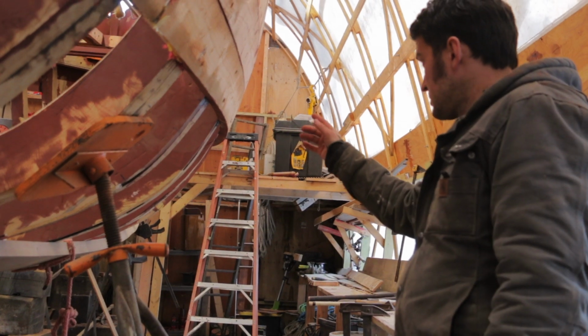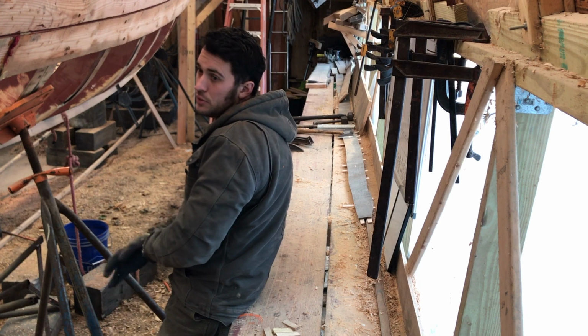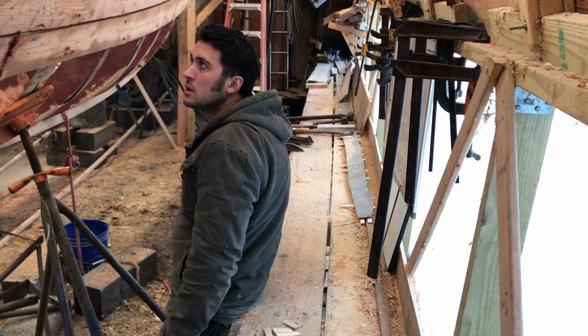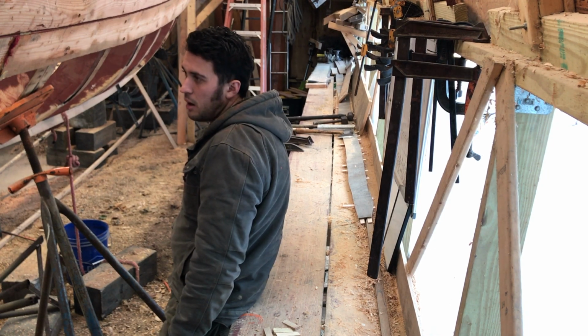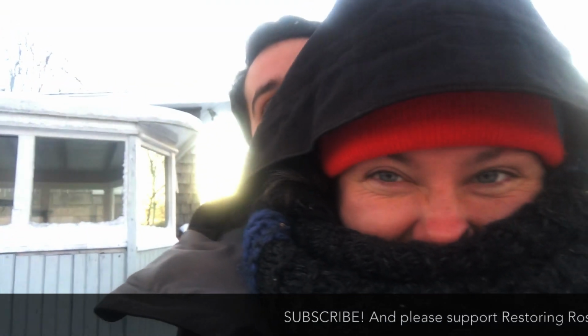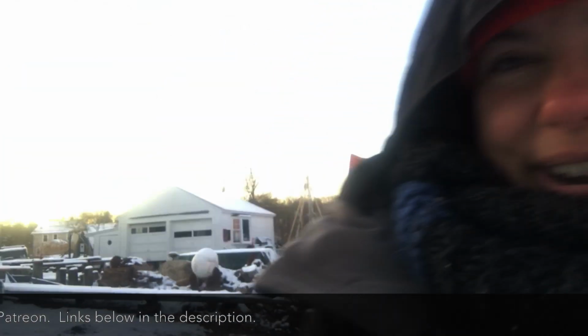They also can limit the scope of further restoration and upkeep and maintenance that you might want to do to a boat, in that you've made a relatively very large hole through something. There's only so many times you can do that. If you want to take a plank off, even on a boat this size, I wanted to take these planks off, and there's a bunch of trunnel holes. I don't know how comfortable I'd feel making a new set of trunnel holes, because then that's weakening the frames quite a bit. So you're more limited in your options as far as disassembly and maintenance and all that sort of thing. But like I said, there's a lot going for them too.